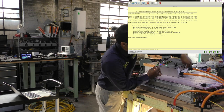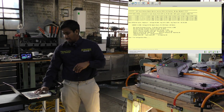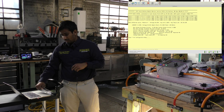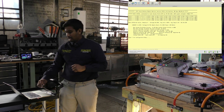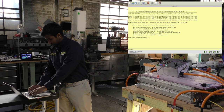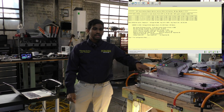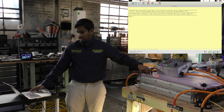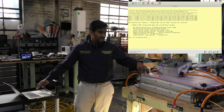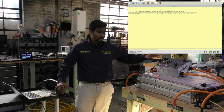With the basic setup, when charge enable is on I can plug in the 2-pin connector that comes with the ESP32 — you get three of these female connectors. Plugging into the 12-volt output shows the LED lights up immediately. Plugging into charge enable, you can see charge enable is on. Entering command 4 forces charge enable off, but it comes back on because our charge resume is still set above our average cell voltage.